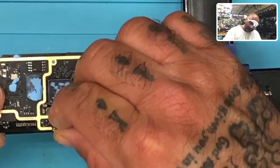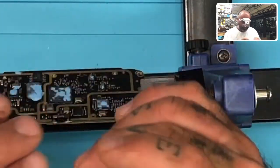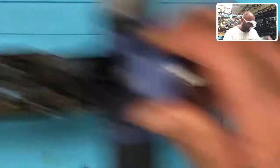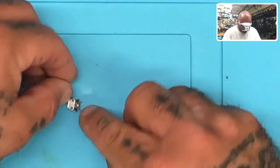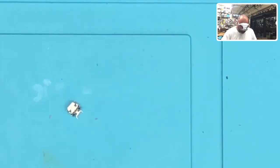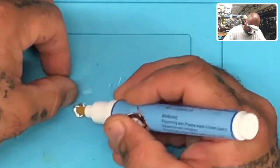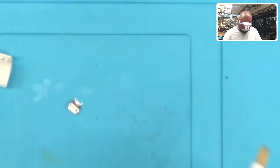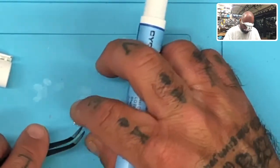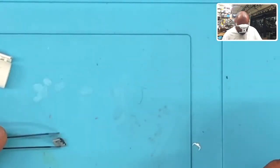Now let's turn this back around and get our USB port lined up. If I heat this up, I think I'd be able to push the USB port through. First thing — on my USB port, I'm going to get the pins ready. We're going to prep these pins. Get our flux pen, and we're going to lay the port out. Apply the flux — just kind of paint it on there, easy, on both sides. The reason you're going to do that is because you are going to prep this upside down. Get your fine tip soldering iron, get your solder, and what you want to do is just lightly brush it on.